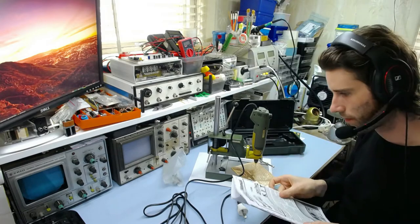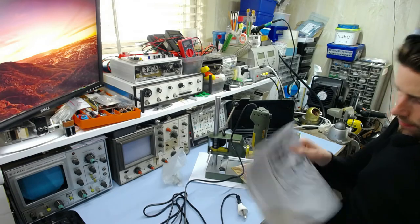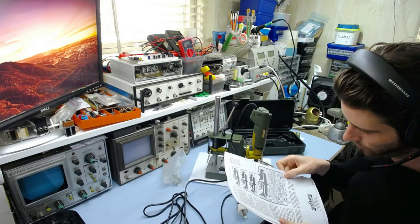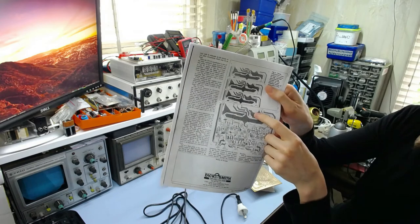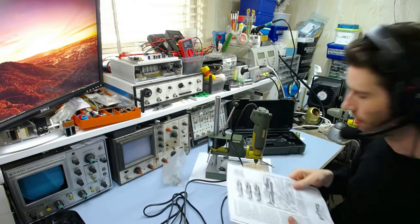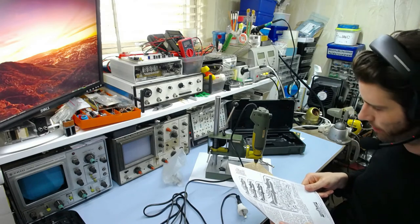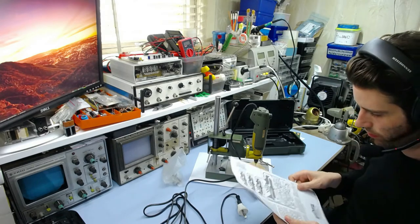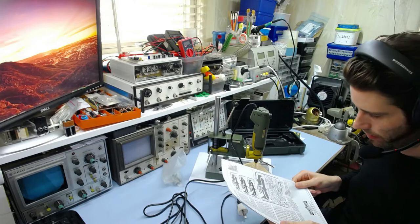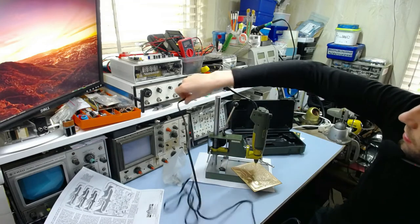I'm gonna grab the manual here, so I can look at the component overlay on here. I can look at which are the large components, which are the wires. So, for example, the bridge rectifier on this power supply, the filter capacitors, the input terminals, the power resistors, those I'll do with the 1mm hole, and all the rest I'll do with the 0.8mm. Except for, obviously, the mounting holes to screw it onto the case, which will be about 3mm or so. But yeah, so let's put that over there so I can see that. Let's tuck this around the way there.